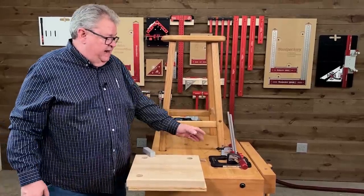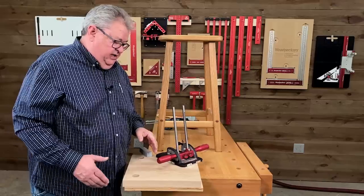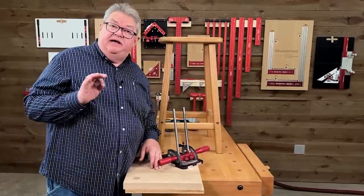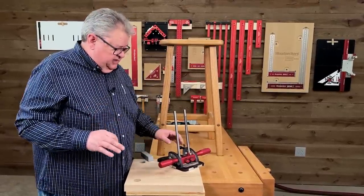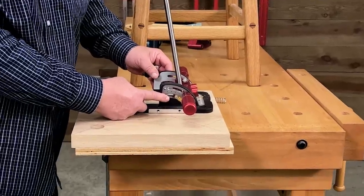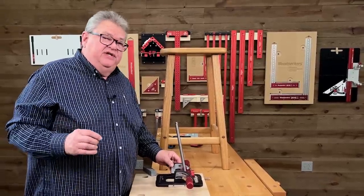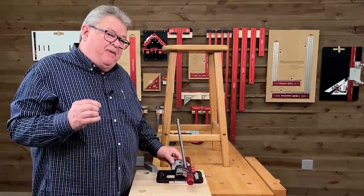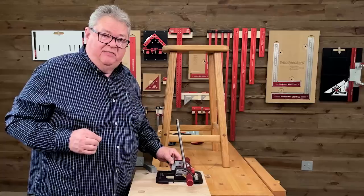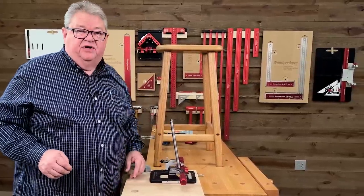Now, when we calculate that, if we're 7 and 7, the resulting angle is 9.9. And that resultant angle is what we set our auto angle guide to. A 9.9, 10 is very, very close. So I'm just on the back side of that 10 degree mark. That's going to get me my 9.9. That's exactly what I did on this one.